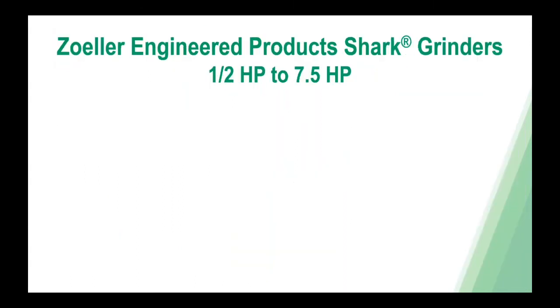Next is our engineered grinders. These pump models under the ZEP brand are engineered for heavy duty wastewater applications with a number of options you won't see in other models. Upgraded mechanical seals and elastomers, moisture and temperature sensors, horizontal flange, and the ability for impeller trims.